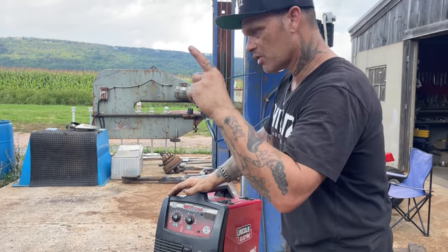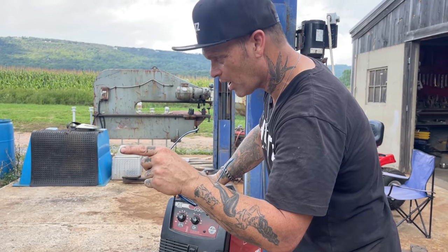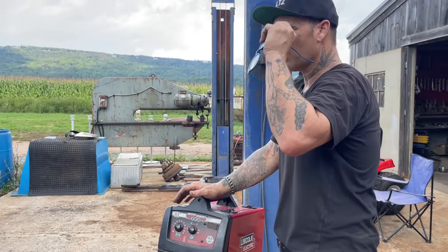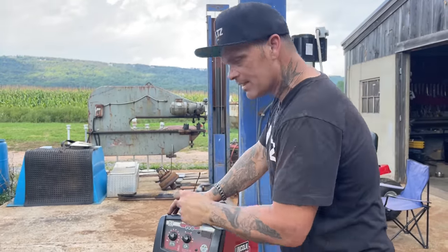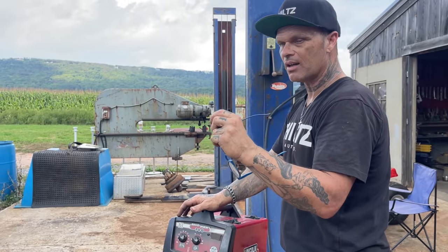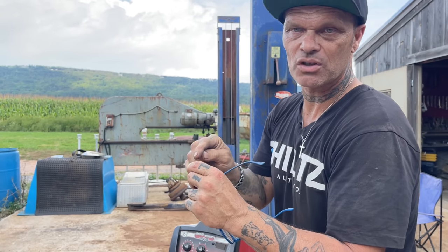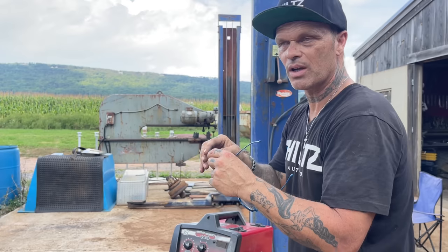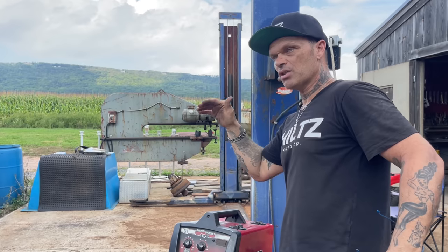When I put the spot weld on the quarter panel, I have one little to start. When I'm butt welding that on, there's probably a 16th gap, sometimes an 8th. It's hard on that heat to not burn through. So what I do is when I get one started, I make sure that I start the tip of the welder halfway on top of the first dot that I've started, 1, 2, 3. That way I'm not burning through and then I can take off and carry on using the hose.